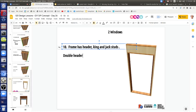We can actually do that in place, because the logic for today was, okay, let's get all the wall modules up so we can start putting on the top plate and the second story, the floor, the joists. So as soon as we have any two opposing wall modules with a top plate, we can start laying those joists. Yeah?